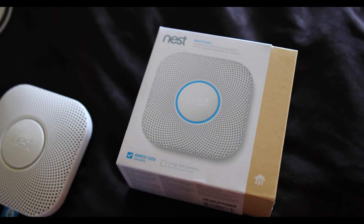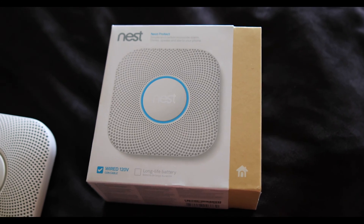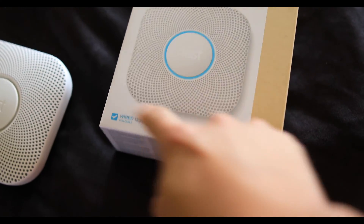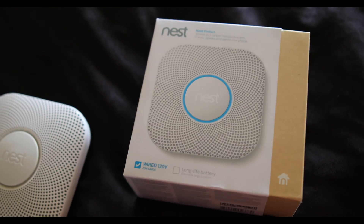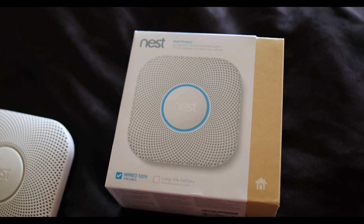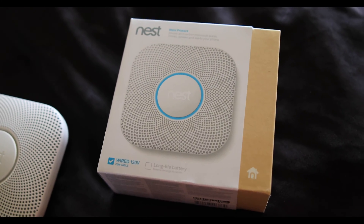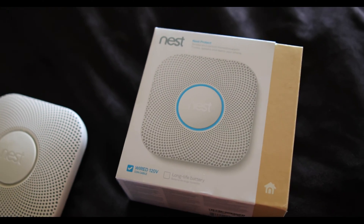Today's weekend home project is to install another Nest Protect. These come in two flavors: Nest wired versus Nest wireless or battery powered. They're both wireless but one's battery powered, one's wired. You want to take a look at what fixtures your current smoke detectors or carbon monoxide detectors are on right now. Basically pull it off and see if there are wires hanging out. If there are not, you need the battery version, which you can place anywhere, versus the wired ones which require wires hanging out of the ceiling.